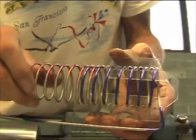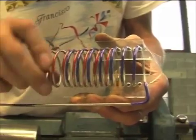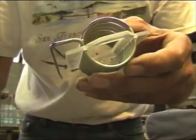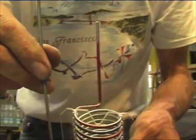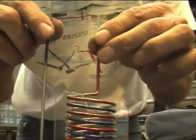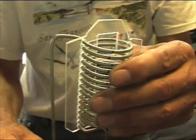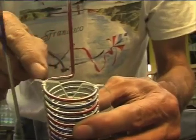This is why you actually have to be very precise when you prepare the spiral and when you drill the holes, so that you will have an easy setup. This is my way to do it in order to have the positive and the negative attachment only on the top, so you can put it into a container. You don't have to drill holes on the bottom. You should leave enough material when you wind it that you can do this, so you prepare this before you start the coil.